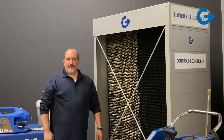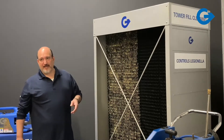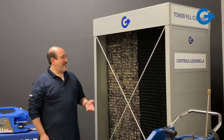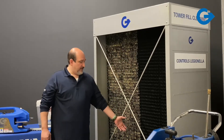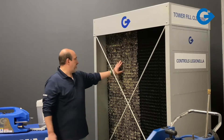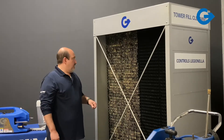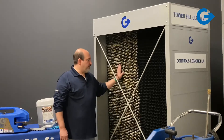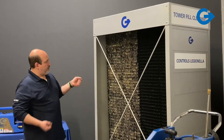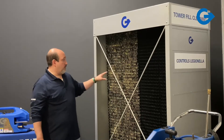What you have in the basin is all that sediment and mud that collects over time. Depending on where you are or how high your cooling towers are, you might get all different types of deposits — anything from leaves, cottonwood, sometimes cicadas, to a heavy sludge if you're in a city environment where your cooling tower is acting like a filter for the whole city. All that smog and air being sucked into the fill deposits down here. Scale — mineral deposits left behind from the water — can also collect on the fill, and it adheres very well to that delicate plastic surface.